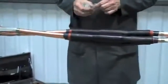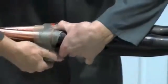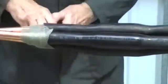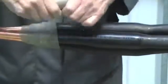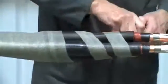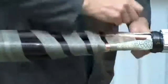Now take the copper screening mesh. Apply it around the copper tape screens and across the joint tubes with 50% overlap. Keep going until the end of the tubes as shown, wrap with an open spiral. And temporarily secure to the armour wires.